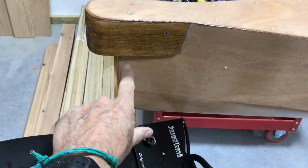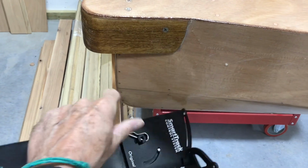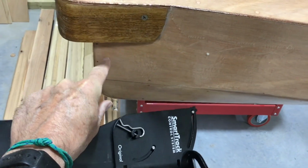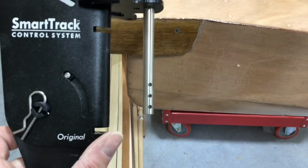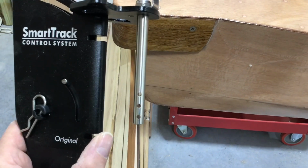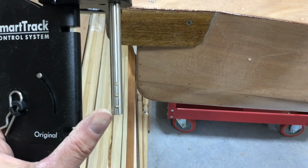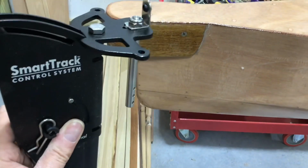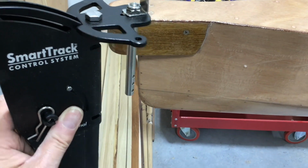but it would have been so close to the back here, and this is so narrow back here, that I was afraid that if I drilled a hole in here, I might come through the side, because this pin is pretty healthy. And I thought, it's just not worth doing that. Plus there would have been no way to put a cotter pin in it. It would have just been sticking down in there, so we would have needed to secure the top in some way to keep it from being able to pop out of there.